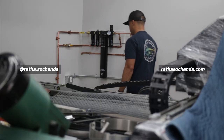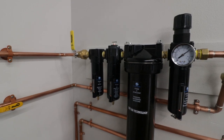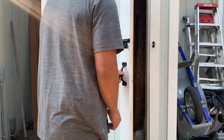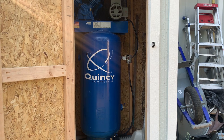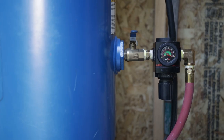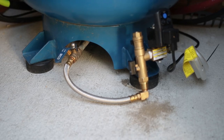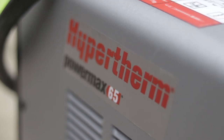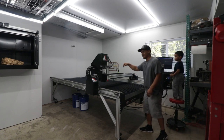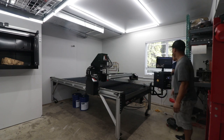Hi, my name is Rata Sachenda, and in this video I'm going to show you how I went from this to this, and show you how and why I built this clean dry air system for my shop. When it comes to the air produced by my air compressor, it's most often that the air leads to condensation and contaminants. If left untreated, it could travel through the air system and cause problems, especially for pneumatic tools whose performance relies on the quality of air delivered — in my case, the Hypertherm plasma cutter used on my CNC plasma table. Because having clean dry air was fundamental to the machine's productivity, I set out to design and build an air supply system to support my needs.